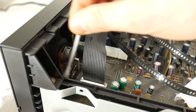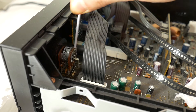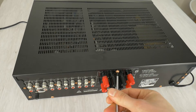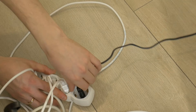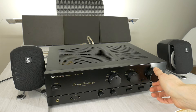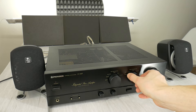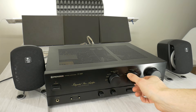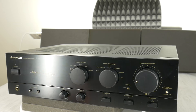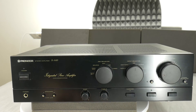At the end, you can collect the excess moisture with a cotton swab. Clean the noisy input selector switch in the same way. Then screw the amplifier back together. Plug it back into the power and evaluate the result. Amazing! Sounds like new and no more scratchy and annoying noisy noises.